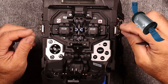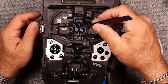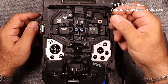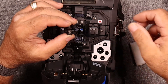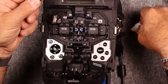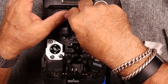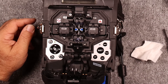It's a lot like doing a tungsten electrode in TIG — you basically put it in, grind it on some fine sandpaper, clean it all off, and put it back in. Once you've removed these two electrodes, I'll just take one out. It doesn't require any screwdrivers — just a little thumb wheel and the electrode sits in here. We don't want to be touching the electrodes. Since I've taken this out, it does have to be stabilized. So we're going to take this, drop it into the holder, put it back in, make sure it's seated, align it with the seat, snug that up — just small screws, don't over-tighten them. Since we've removed this, we have to do an arc stabilization.